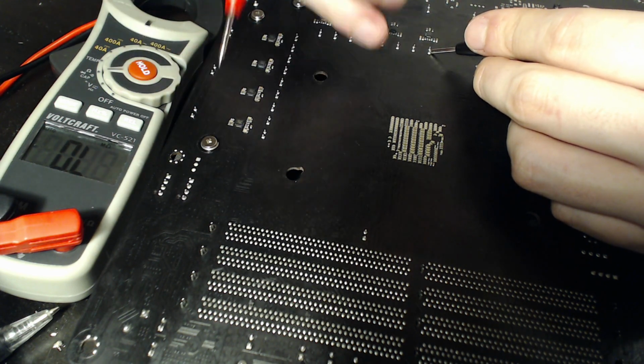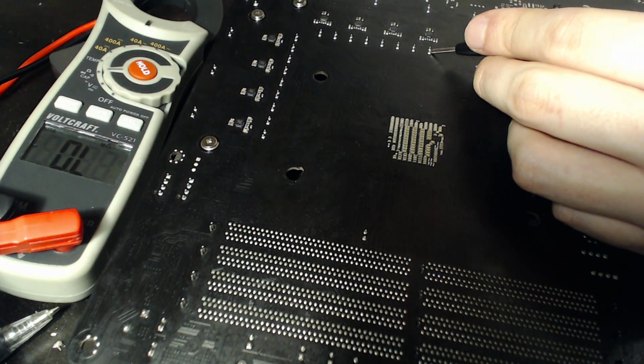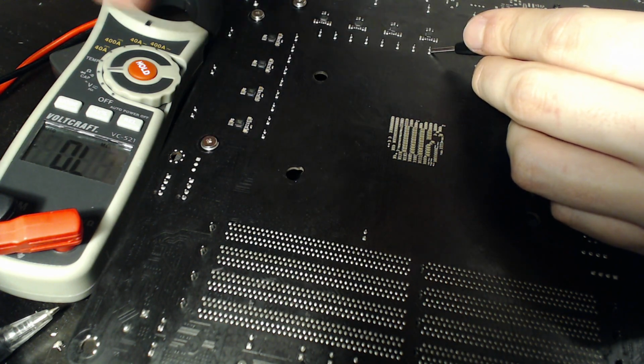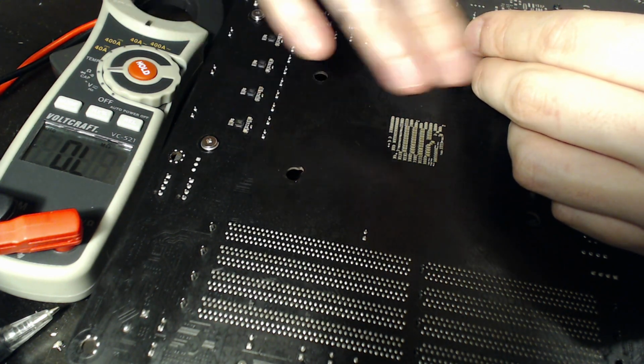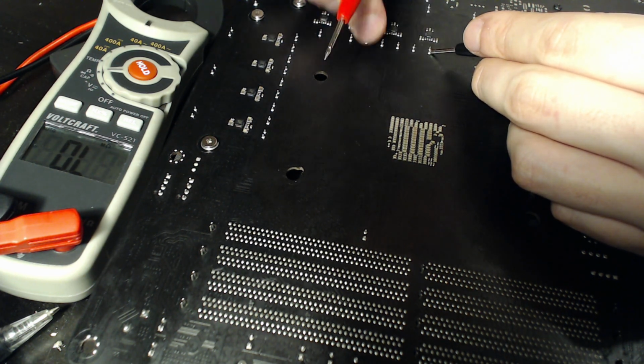These are bypass capacitors. They exist to clean up the switching noise from the CPU, because as it switches, it causes current fluctuations. Those naturally cause voltage fluctuations. The capacitors are there to soak up those voltage fluctuations and basically remove them. And capacitor selection actually changes how well a board can overclock, just because of the selection of capacitors back here.